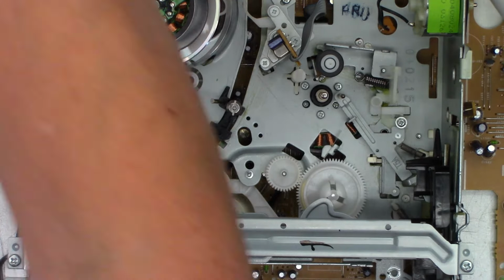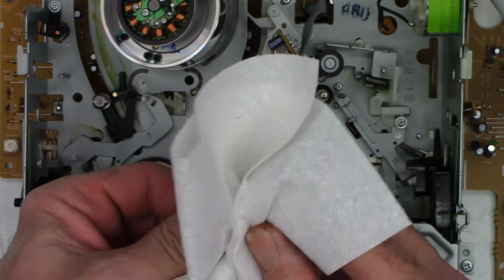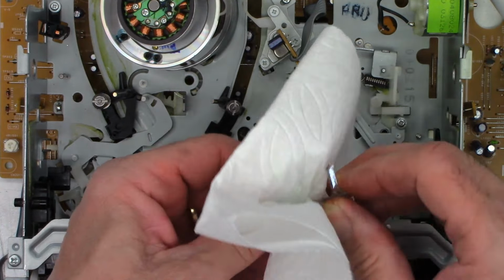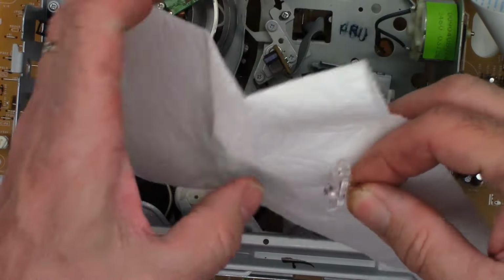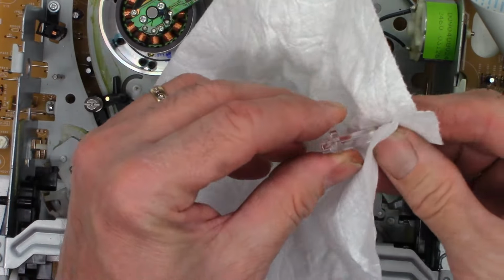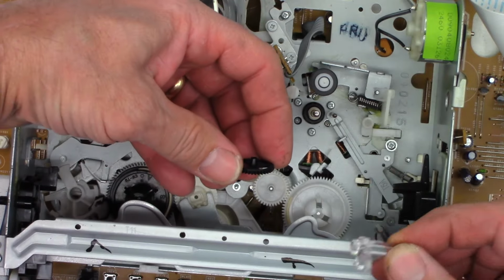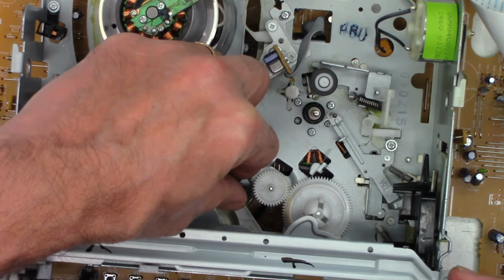Okay, next for the Prism. So I'm just going to get a paper towel, shoot some glass cleaner into it, and then we'll just wipe this whole thing off right here. Cleaning all of the edges, all of the sides, anything that you see, because dust will cause the light or the infrared signal to be diffused out of this thing. I've had problems with these in the past, and just simply wiping them off solved the issues. Okay, I'm liking that. The gear goes in with the conical side facing up and then the flat facing down. Just like that.